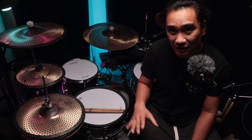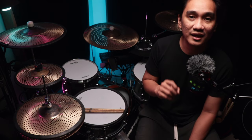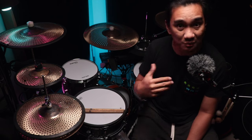Not that I'm avoiding hot spotting, which by the way is close to none even when hitting the cone directly, which says a lot about the quality of the R-Drums trigger, which is amazing. My point is, if you get more head piezo than rim piezo, that would kind of cancel the rim shot. If I understand it correctly, you need more rim piezo signal and just a bit of the head piezo for the rim shot to play.